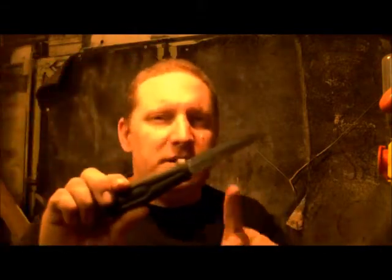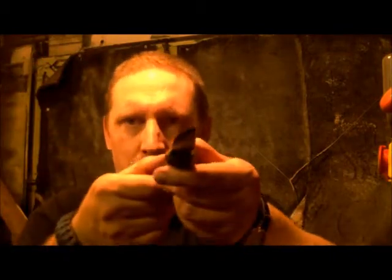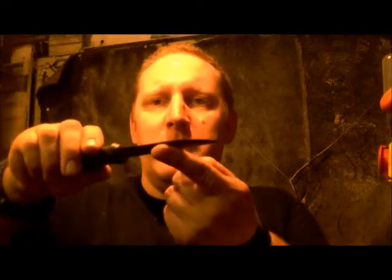Okay, so this isn't the true Scandi, but your Scandi, you have the bevel of the knife where it's sharpened or ground off on a machine, and you literally find the bevel by lifting the blade up until it just sits flat on the stone, and you just go backwards and forwards and back the other way. A lot of stuff is convex, and then you're putting a terminal bevel on the edge of it.